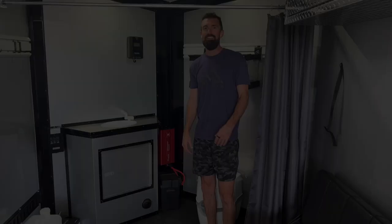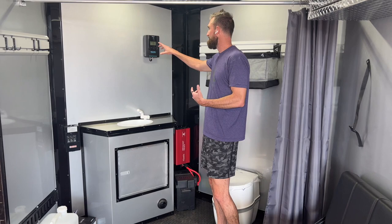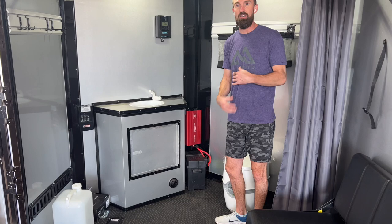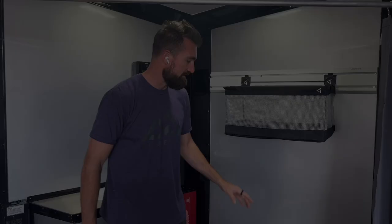In the same vein as solar, it's really important to have a battery that communicates and works well with your solar system. On your charge controller you have to set it up to tell it what kind of battery you have — we upgraded this to a 100 amp-hour lithium-ion battery. We also added a 3000-watt power inverter so the customer can run his microwave, coffee pot, and other appliances without having to fire up the generator. It pulls 12-volt power out of the battery, converts it to 110-volt power, with 3000 watts available — which is a ton.